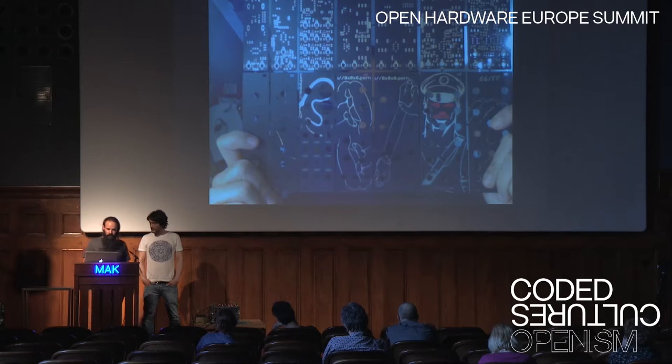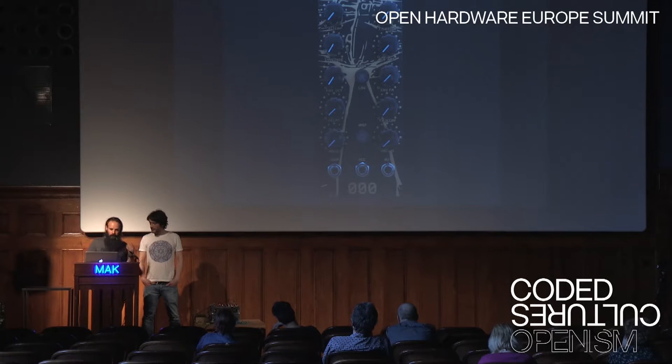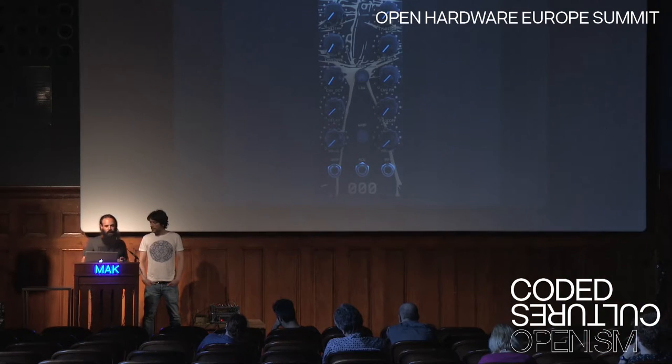We started to play with these concepts and make them more standalone. After working with all these models, we had to start to sophisticate the designs much more and work with more complex synthesis to make all these different models. The last functional model is the TOMS — we call it TOMS of Finland, related to the great comics. It involves adapting FM synthesis and translating it to percussion. Right now you have all this precision FM synthesis in the oscillator, combined with our ideas to have longer decays, make drones, and make more versatile modules.